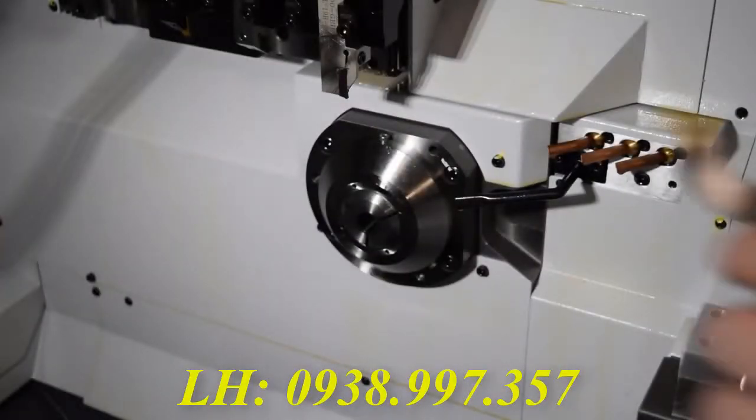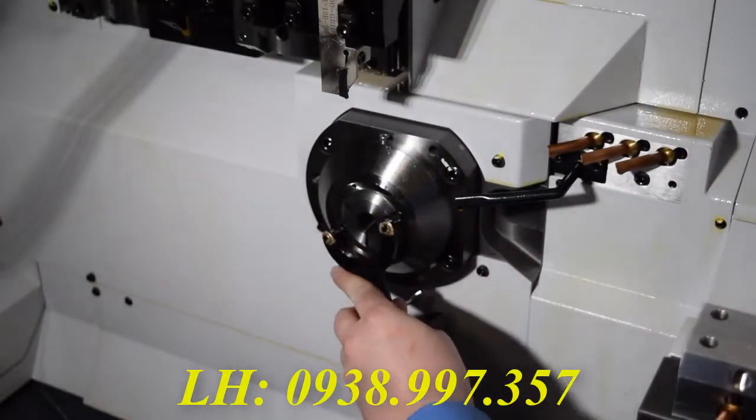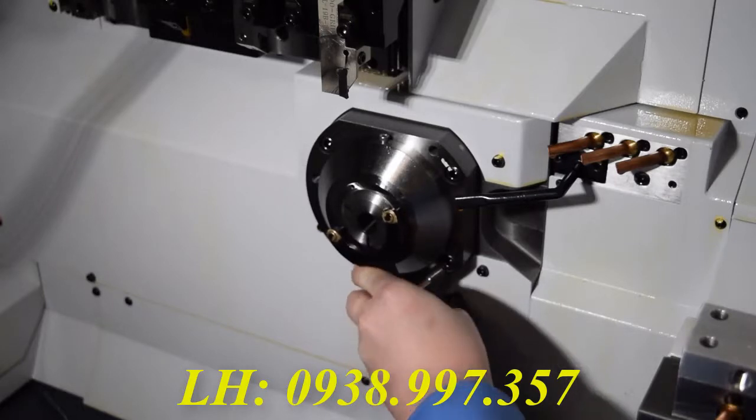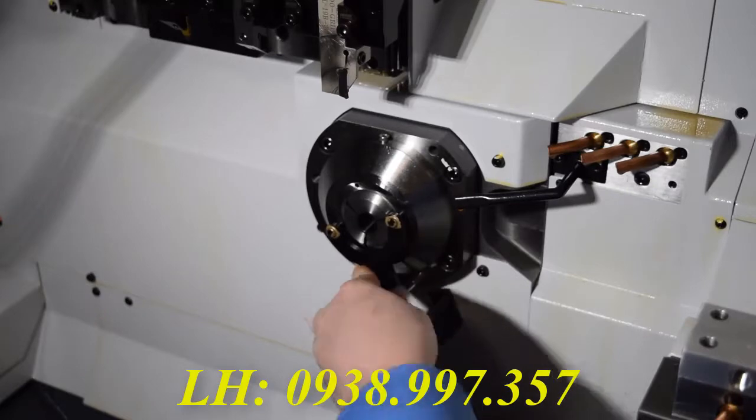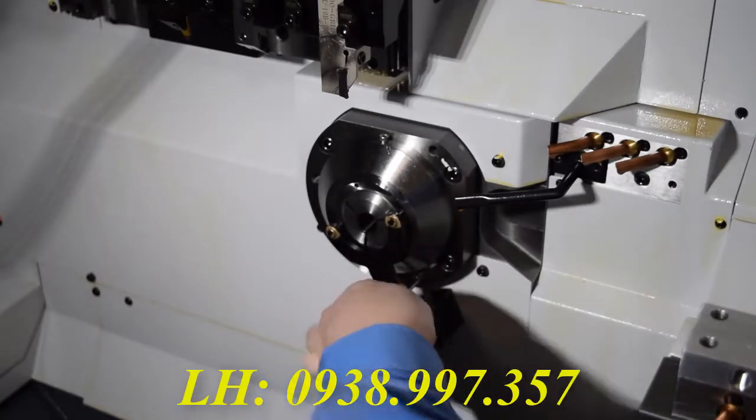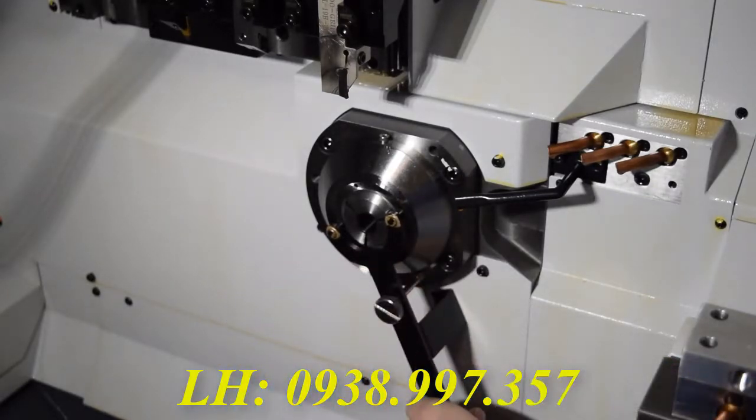Next, onto the guide bushing. A tool came with your machine that fits into the holes on the face of the guide bushing unit. Once in place, you can lock it down with the silver screw in the base of the handle. When finished, it never hurts to check to make sure it's secure.